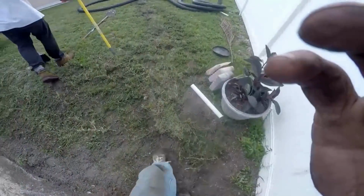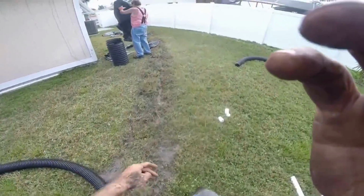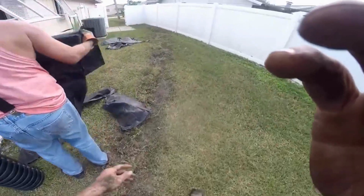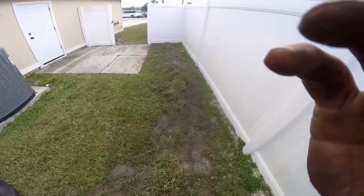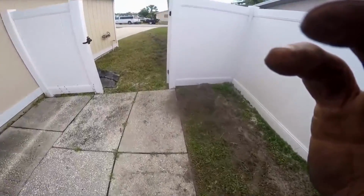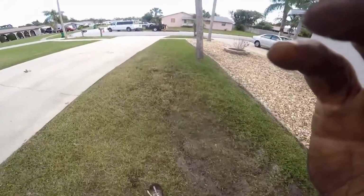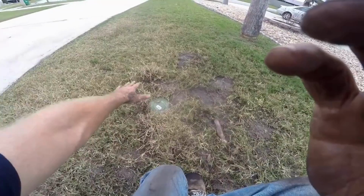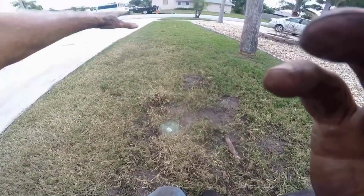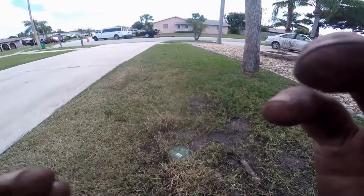We've also got our 1.5 inch pipe running underground all the way out here to the front, and I'll show you where that discharges. We're just cleaning up our material and we'll be making out a bill here, and we're pretty much all done. We'll blow the area off and it'll look really good. But you can see how far this line comes out, and right here we've put a pop-up because from here we've got good gravity that'll let this water run all the way out to the street out there, to the curb where their storm drains are supposed to pick it up.